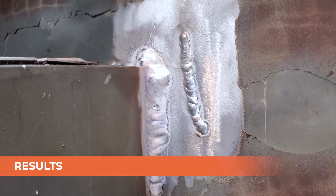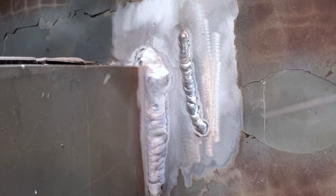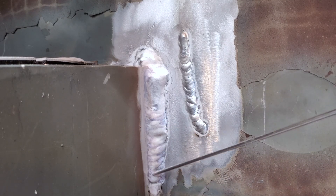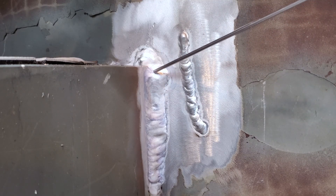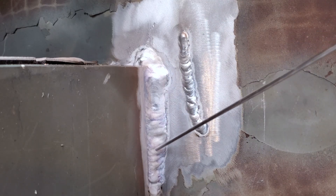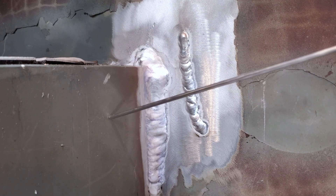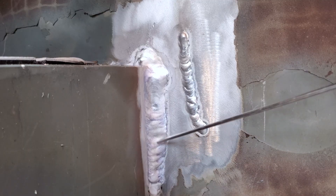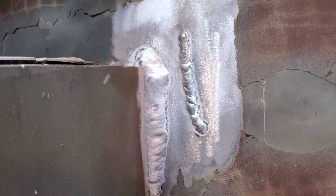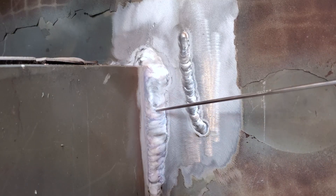Let's take a quick look at our welds. The small weld — only a saw-width with two three-sixteenths holes at either end — welded up nicely at 105 amps. However, over on the larger hole, we had about three-sixteenths gap at the bottom, and right at the elbow shape around the corner it ended up being almost three-eighths of an inch. That required a lot more heat because not only did we have this panel, but the other side of the crack had that panel plus this panel coming right up to it — a lot more aluminum in that area. After starting I quickly realized I needed more power, so I stopped and turned the machine up to 135 amps, which allowed me to get more filler and more heat into the crevice.